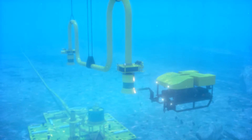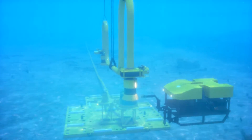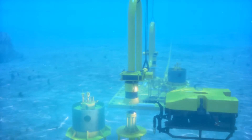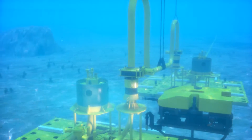The fabricated jumper with clamps already installed on each end is lowered into place from the service vessel. The ROV will land each end independently to ensure proper seating. Once properly seated on the softland structure, the ROV will begin the final installation sequence.